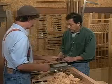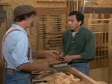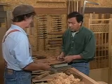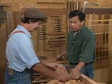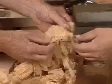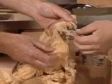So if you want to do this kind of work, even with Western planes, you better learn something from Japanese sharpening technique. Yes, you need to be able to sharpen. I mean, you can see the shavings are on the order of 5 microns thick. That's astounding.